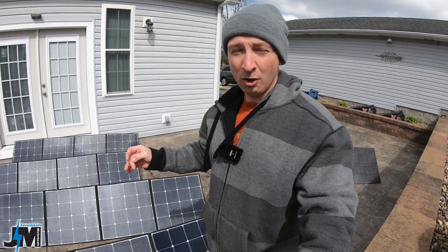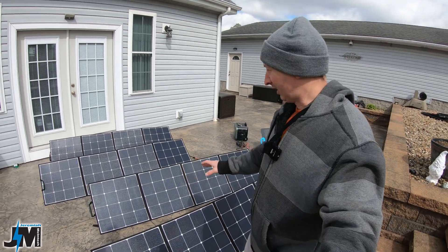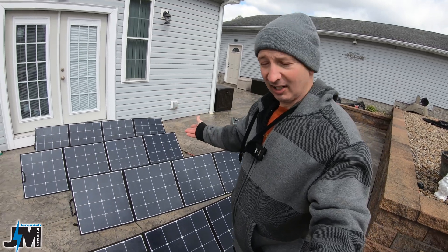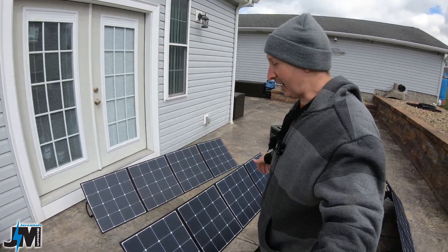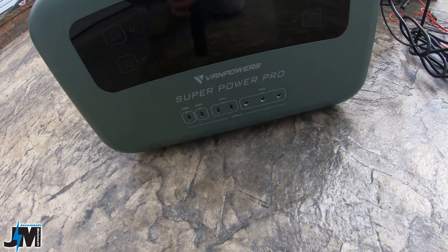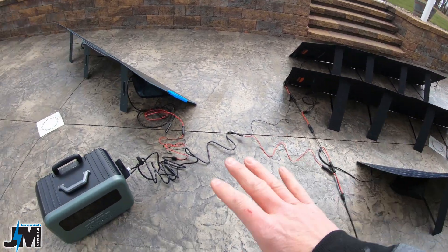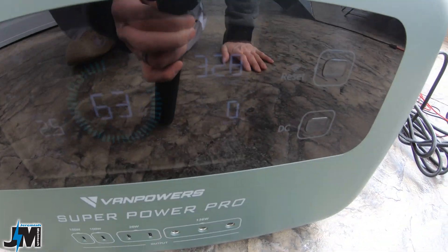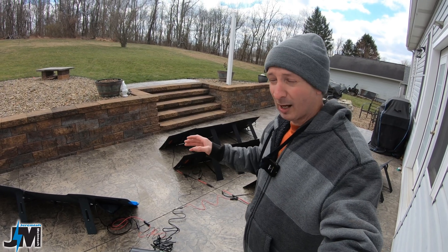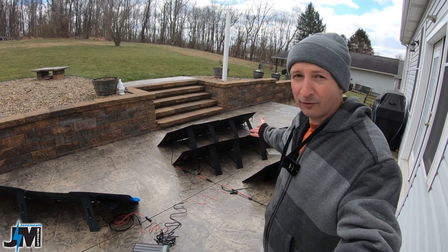In my original review video when charging with solar, since the panels were in series, when I only had two panels connected and walked in front of them or they got shaded, the input would drop to almost zero and never ramp back up. With four panels in series, I can walk in front of them with the sun behind clouds and still get 300 watts of input — it never lost all output. And when the sun comes back out, it ramps back up without having to unplug and replug. Also interesting: 1,100 watts is actually more than 200 times 5, which is 1,000 — so I'm getting more output into the unit than these panels are even rated for connected this way.